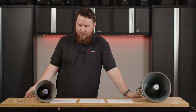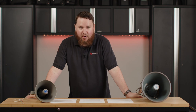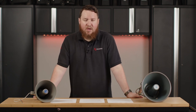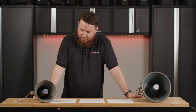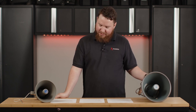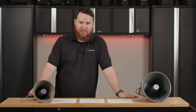All these benefits make horns great for paging, voice, emergencies, warehouses, parking lots, public parking places, and public buildings. Many horns like these two here can be used in 8 ohm or 70 volt applications. These are two of our favorite options here: the Yorkville C180, the Coliseum Mini outdoor horn, which is great for many of the applications mentioned, as well as the Atlas GA15T, which can be used in a 70 volt application as well as a 25 volt system.